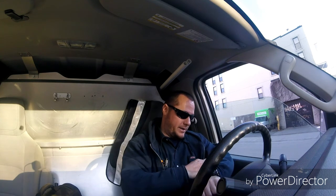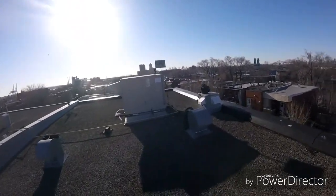We're also going to recover the second circuit, repair the damaged pipe, and recharge it with what we reclaim — hopefully the full nine pounds. The unit is over 10 to 12 years old and we need to get them cooling for the summer. Today is March 30th, 2017. Let's start bringing our stuff up — that's the unit right there.